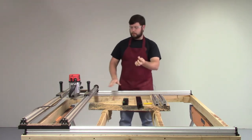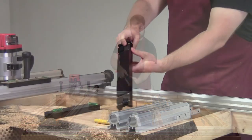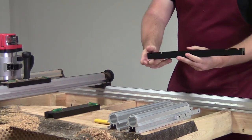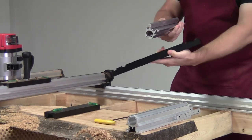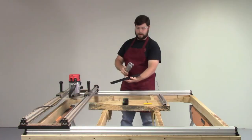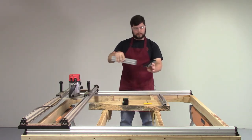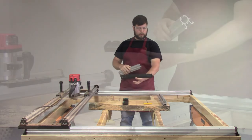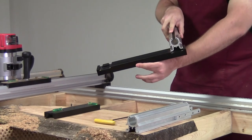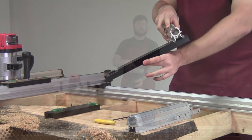All of those sliding components are affixed to the rails with end caps. Those end caps fit down into a little machined-out portion, and we have little raised pyramids that match the bottom of the extrusion. Instead of having end caps bolted to a flat part with a gusset system, we machined out a relief area that matches the bottom of the extrusion. So when this is bolted down — and we use shoulder bolts — everything is captured, giving you a very strong, very rigid connection.